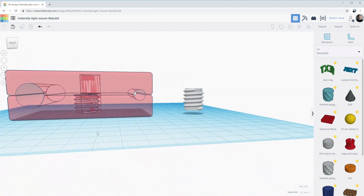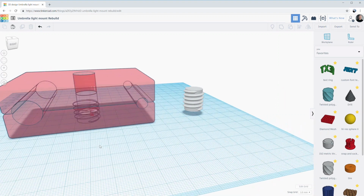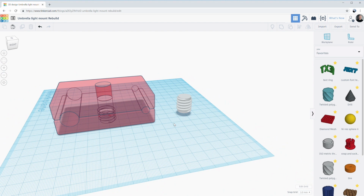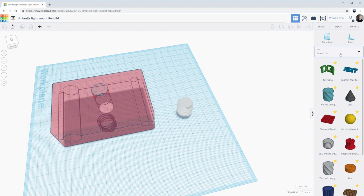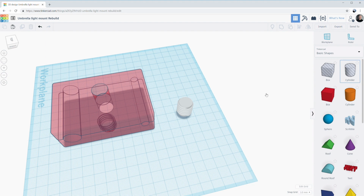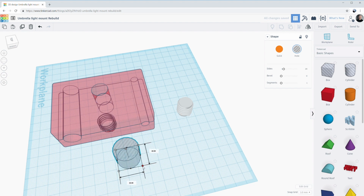That's good. Now, what we'll also need is a hole in the upper plate to allow the bolt to extend through into the lower plate's thread. Now, that hole obviously needs to be larger than the thread. So let's go with, actually, we could just leave it at 20. Our thread was 16, so that would be plenty.